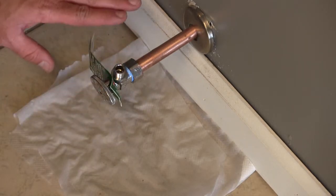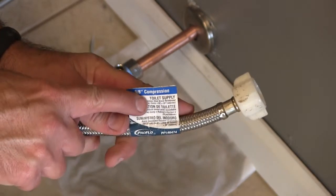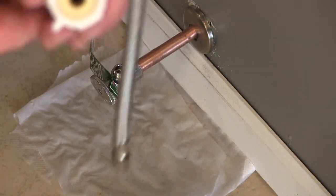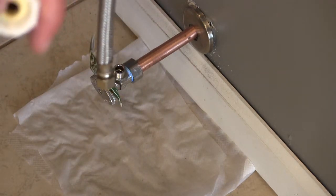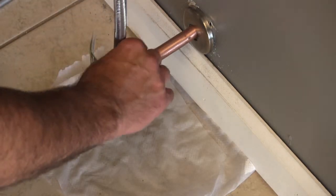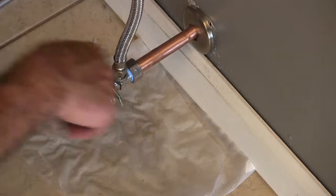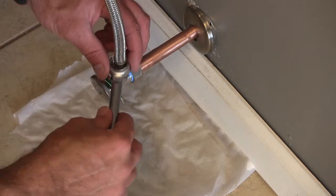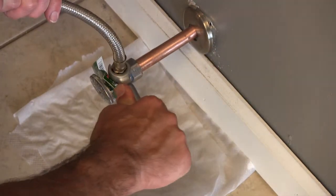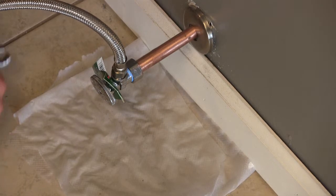This is the supply line you can buy at your local hardware store — it's got a 3/8 compression fitting and it's a toilet supply line. You've got to make sure you're buying the right one. There's a rubber gasket on the top that connects to the tank, and a rubber gasket on the bottom which connects to the actual compression fitting or shutoff valve. Hand tighten first and then wrench tighten, using controlled turns. This supply line has a rubber gasket on the bottom side, so I don't need Teflon when I have a rubber gasket. I'll grab a crescent wrench and tighten the nut on the supply line to the shutoff valve using the 3/8 side of my one-stop wrench.